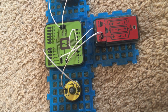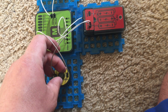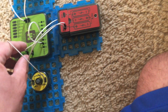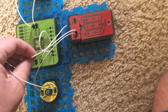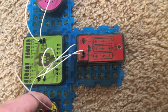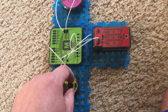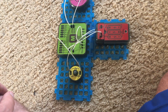If you want to slow down you would turn the variable resistor to the left, as if the motorcycle is slowing down and then idling again. Removing this wire from the M plus terminal is like turning off the engine. You can turn the knob at different rates to pretend that you are accelerating or decelerating. The microprocessor is programmed to create electrical impulses at the same frequency as a motorcycle engine, so when the impulses go to the speaker and are converted into sound they sound just like a real motorcycle.